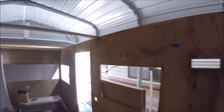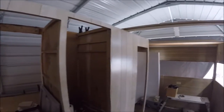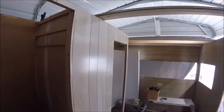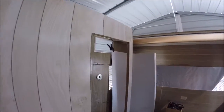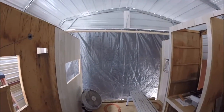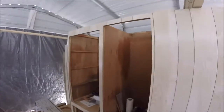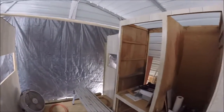If you've got a trailer and you take all the cabinets out, you've removed all the structural integrity — that's all that really holds it together. You have no sway strength or shear strength without the cabinets. So that's not something you want to do. We don't gut trailers — we gut fish. And you see what happens to a fish when you gut it.